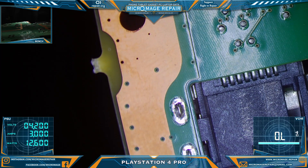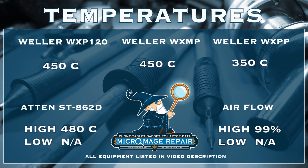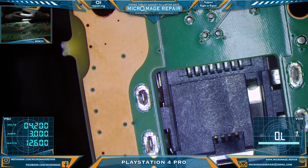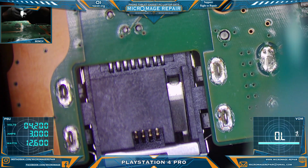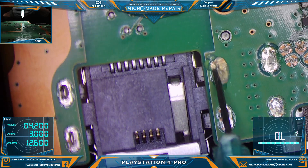While I'm setting up my equipment and switching everything on, those are the solder temperatures I'll be using. I don't anticipate using the Pico pencil, but if I have to run a jumper that's what I would use. I may have to adjust the hot air down depending on how difficult the port is. If I see melting I definitely will, but we'll try with our normal temperatures first.